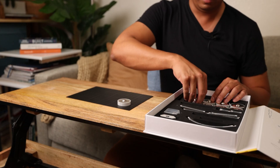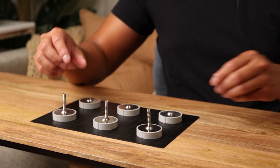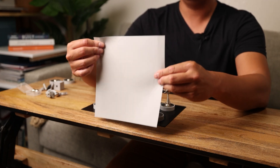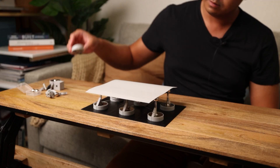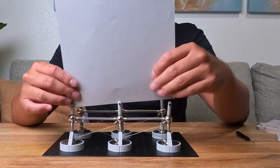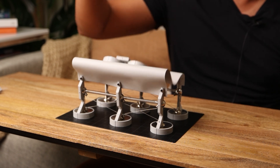First, let's get this building structure up using the MOLA 4 kit. Almost everything snaps together magnetically, very easy to build, no instructions needed. It comes with joints, stiffeners, wire braces, and more. All we have is this piece of paper for the roof. If you're a normie that doesn't know engineering, you'll go with the most straightforward way — just make a flat roof. But it doesn't take much load. If you have some engineering skills, you'll ask yourself: what happens if you just bend the roof? Make it into an arch. We'll attach the roof to the structure with these connections. Now if we load it, it can take more load. But why?